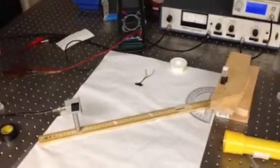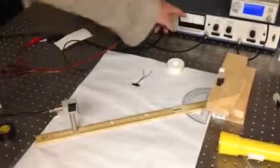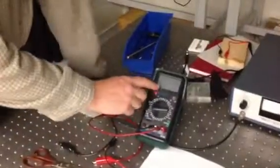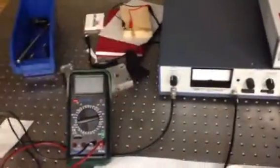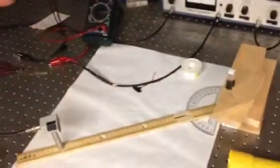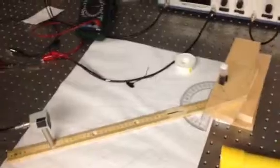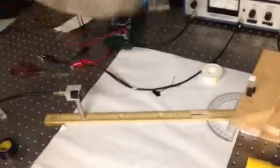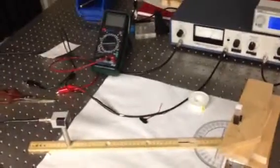The students will get that data from the lock-in amplifier. This is just a gauge. You actually get the output from here. You just hook it into a voltmeter, and it'll give you a multiplier between 0 and 1 for the sensitivity scale. So it's pretty straightforward. Now you wouldn't even have to have a lock-in amplifier if you just turned the room lights off and got up a little closer. So I don't know if you have one or if you don't have one.